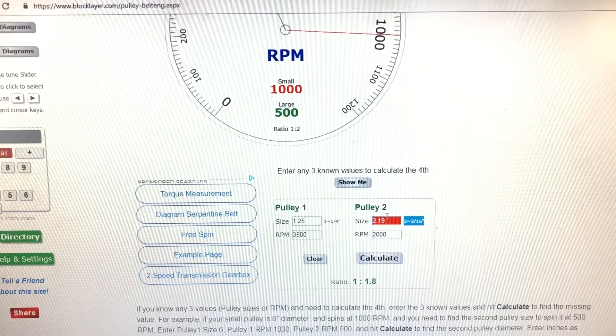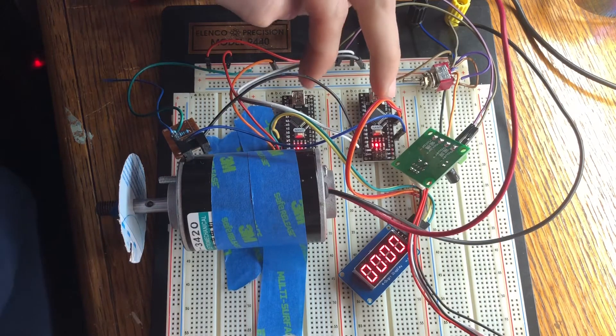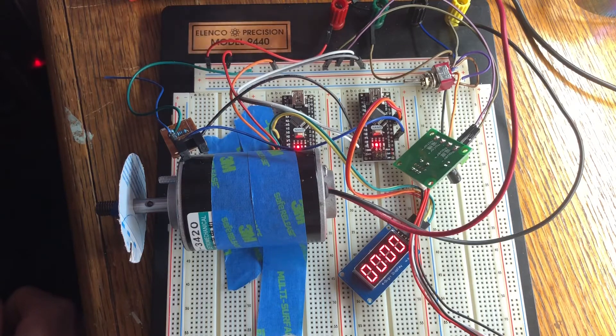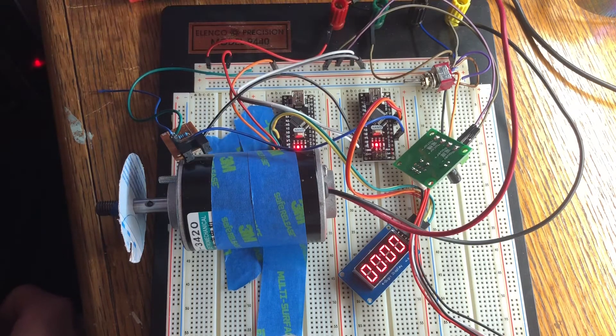So when we make this, I'll divide the 2 and 3/16 in half and set the bit up to make that size pulley. Now I'm going to zoom down and show you the motor and how I've got everything set up. So here's our setup. In the last video I made the power supply for these, but thanks to subscriber ATHF226 — he said don't worry about doing all that, just plug them straight into 12 volts, and he was right and it worked perfect. So thank you for that suggestion. I've got the 12 volts coming in from my wall wart going directly to both nano boards.